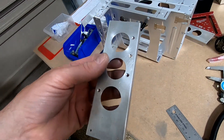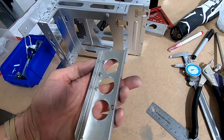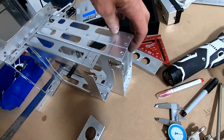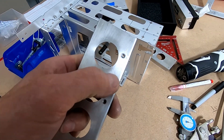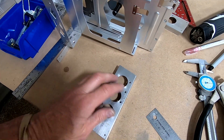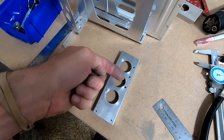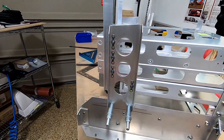I have a reason to redo it: I'm going to take out these clinch nuts because the holes for the 6-32 screws are so big they don't fit tight — the countersunk screw just bottoms out. I'm going to put nut plates in that mount from this side, and that'll allow me to open up the hole 30 thousandths in each direction to solve the problem. If you're planning on doing a fancy aviation rack with precise drilled holes, don't bother — just treat it like drywall. Got the nut plates in. Happy with that — it all worked out.